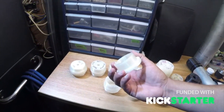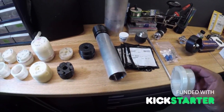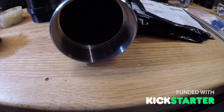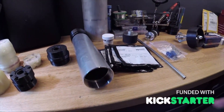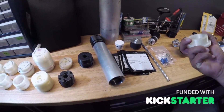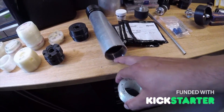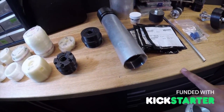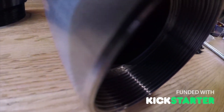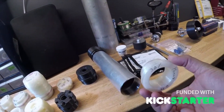Originally the plan was to do what Pacific Meister was doing, using aluminum tube. The tube he was using was much thinner — about half this thickness — and it's not a standard size, so it takes six to eight weeks to get a piece and you pay a premium. What I did was get a standard size that's a little bit thicker but the same inside diameter, which gives much better cooling for the motor and allows us to put threads in it.